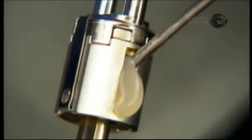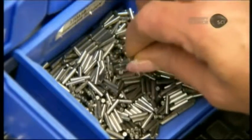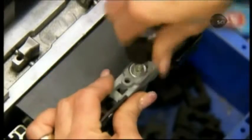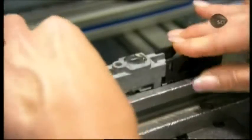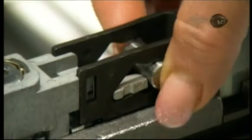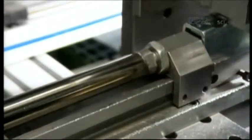Workers give the cylinder grooves a squirt of grease, the housing as well. Then they insert pins into the grooves — these act as blockers, preventing the wrong key from opening the lock. With the correct key, they give way, enabling the cylinder to rotate within the housing. A spring applies tension to the cylinder's steel anti-drilling plate, keeping it in position so that the key inserts easily. On each side, workers insert a lever and bolt. When you turn the key to the lock position, the lever pushes the bolt into the shackle's notch, immobilizing the shackle. A component spring-loads the bolt to prevent the inserted shackle from popping out prior to being locked.